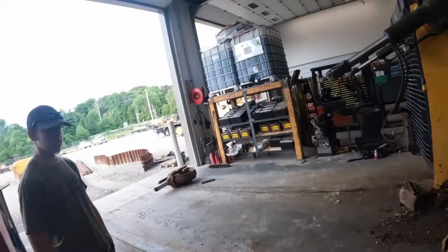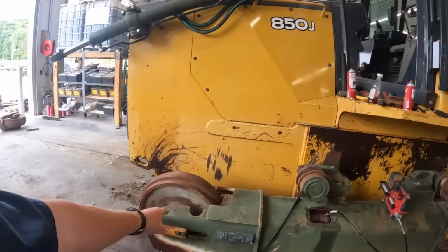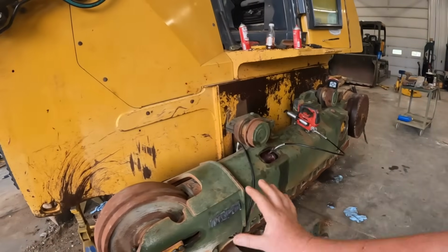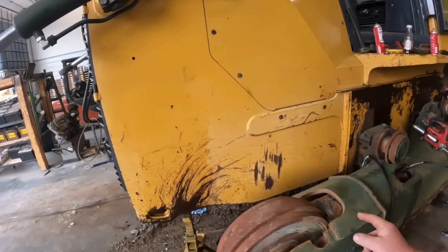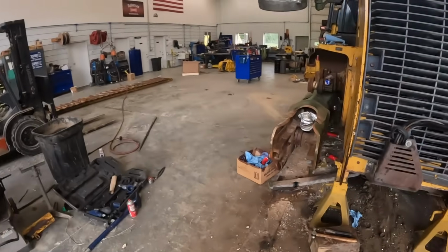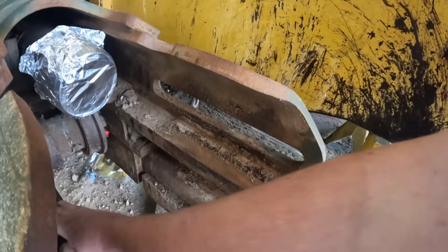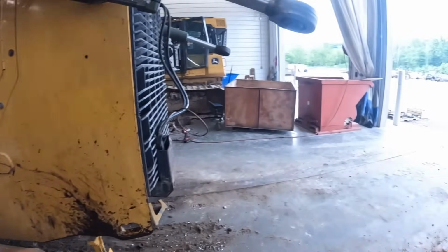All right, we're back. So you guys are watching. We've been fighting these stupid front idlers for like a half day on Friday. It's Monday now. So what's going on with these things? Remember I said these have 195 hours on them. They're like probably 12, 13 years old at the time. So they've been sitting, and since this thing's not been run very much, there's no clearance in here. And what happened, it actually kind of rusted in the track frames here, just from age and sitting. They got so tight they wouldn't come out.